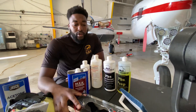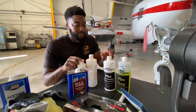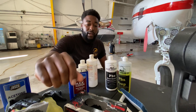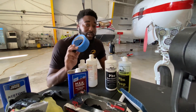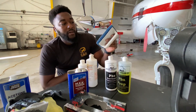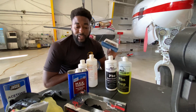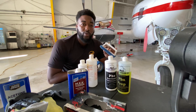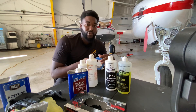Things you'll need are gloves, MEK, either the Goodrich or the PBS boot sealant and prep. If you are not going to wash the plane, you will need two inch tape to make it a lot easier. And this scrub brush — I got it from Walmart for like a dollar, two dollars — is the best thing I've found to use to strip off the old sealant that's already on there.